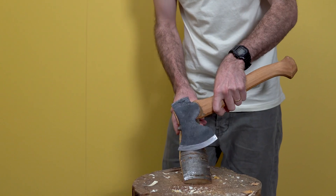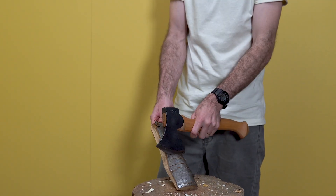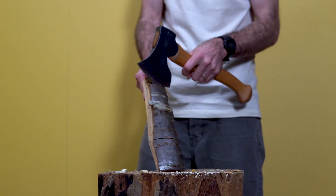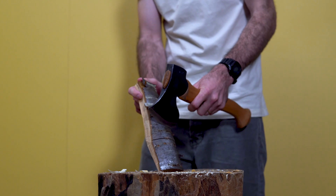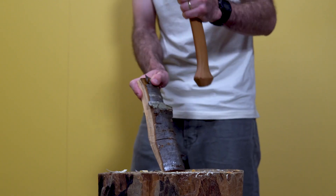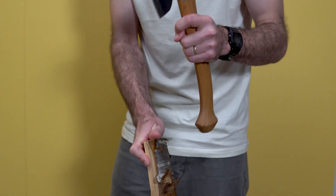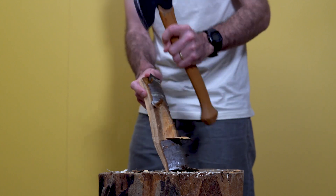I've already put a stop cut in here, but I'll show you some tips. When you're taking out the bowl section of a piece of wood, it's really nice to start with some relief cuts to loosen up the fibers — just doing a couple of small cuts. It frees all of that tension up, and you can do it a few more times if it makes you comfortable, then move back down and it will slowly peel out all of that wood.